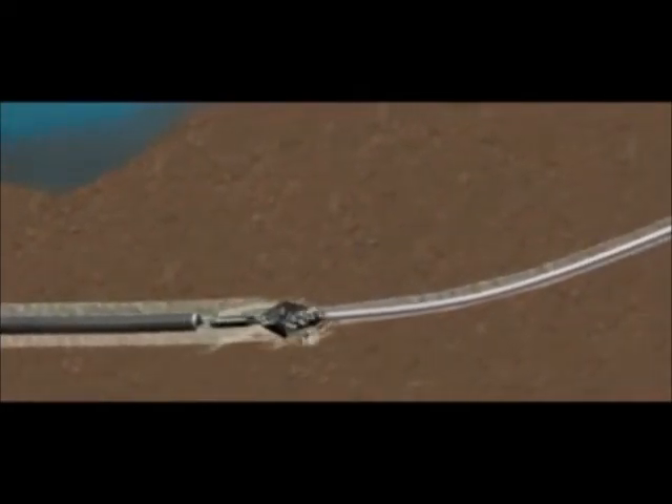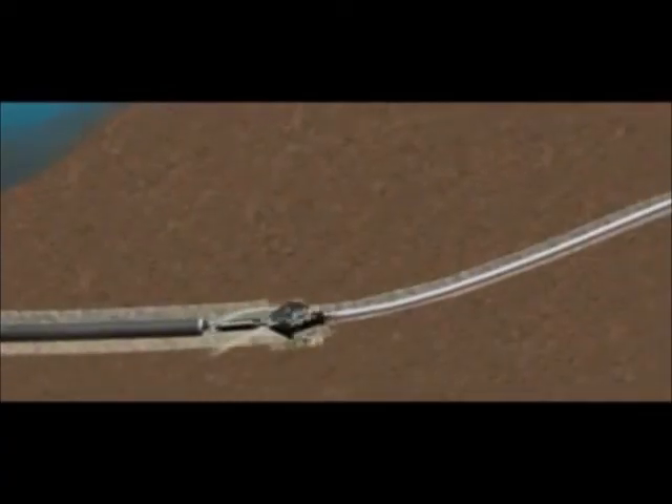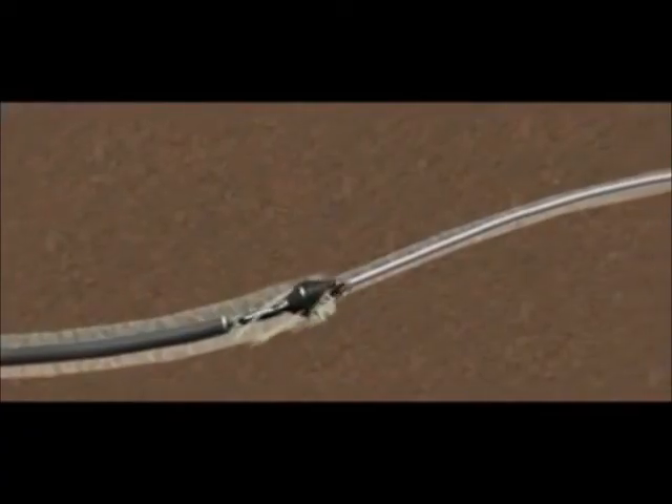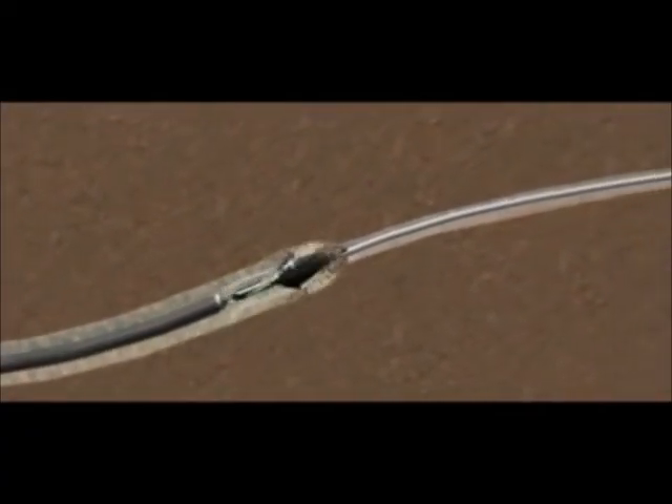AMS Nodig have various types of reamers including barrel and rock reamers, fly cutters, and hole openers with either TCI or mill tooth bits, dependent on the rock strengths and types.